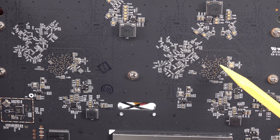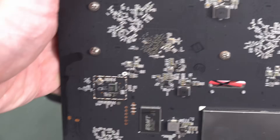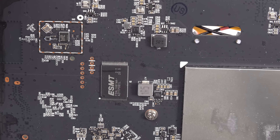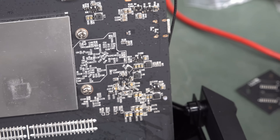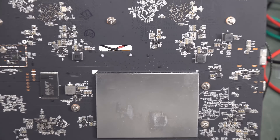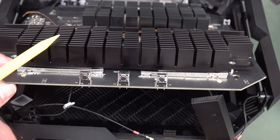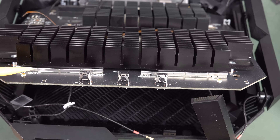I love how they got the silk screen for all of these tiny little components. Are they 0201s? They're absolutely tiny. Those bypass caps — that's horrific. So I've obviously got two very dense BGAs under there. Looks like there's an oscillator down there — that's a PLL in there. And I've got some memory — that'd be the flash. There's a very nice shielded can which looks to be soldered down, so I'm not getting that off. And then a whole bunch of miscellaneous power supply stuff. It's interesting to note that the heat sink is on top of the metal can — it may just be a shield around the outside of the die with the heat sink directly on the die, because it'd be poor thermal design to have extra layers in there.